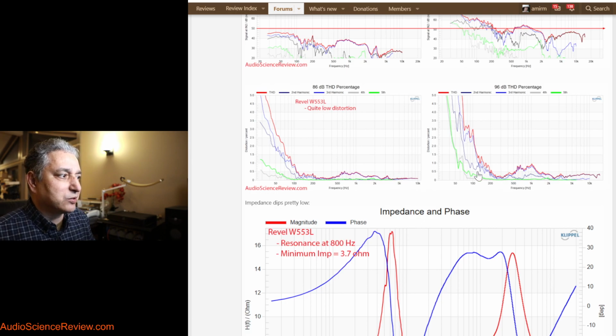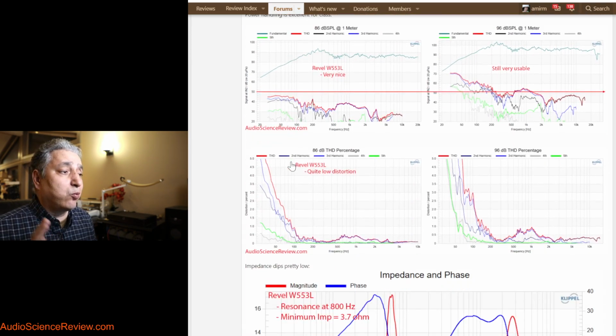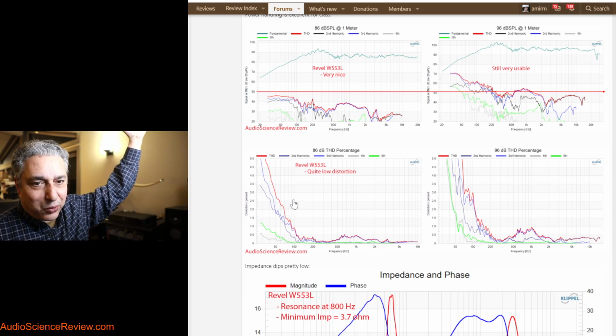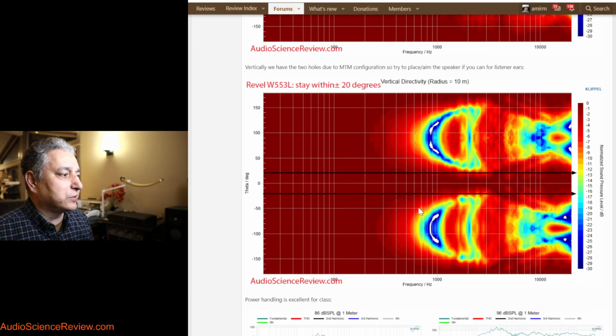Part of the reason this bass response is good is because you have the two woofers in there and the back is not constrained in a small box. So, going to one woofer, like a bookshelf speaker, you would have lost a lot of power handling. If you have to stick a speaker way up by the ceiling, then think twice about using this speaker, because your response is going to look like this.